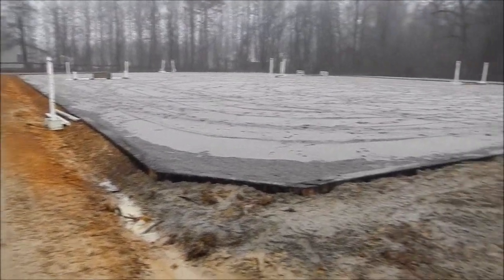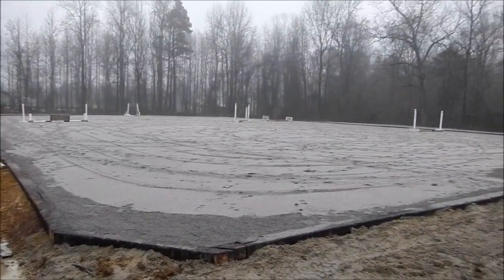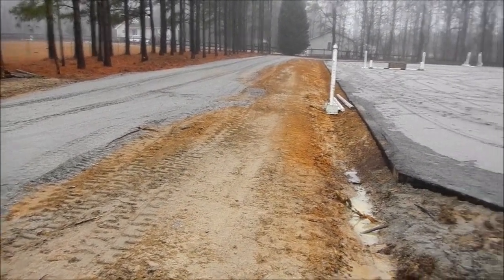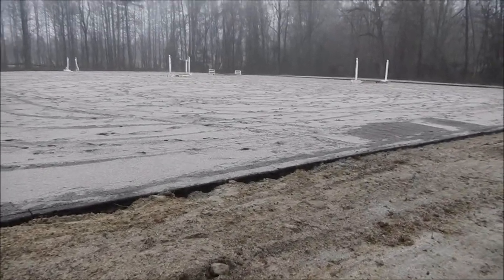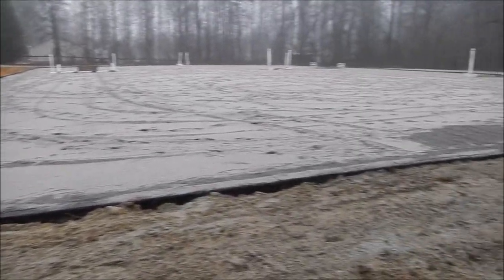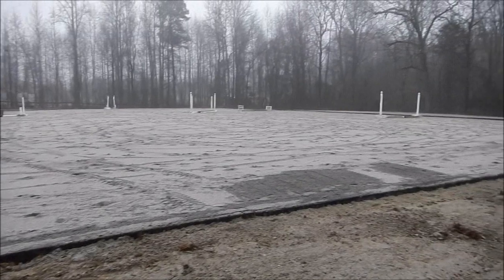Here it is at the end. We've had a lot of rain since I finished it, so I just finally got back out here to get the last piece of equipment. There it is — a 24,000 square foot horse arena. She's already put her stuff in there. We got a road that goes around it where I cut it down. I put a little ditch on the uphill side so the water can run around. I got a four inch crown in it from the center halfway to each side so that the water will run off. And we surrounded it in old railroad cross ties, pounded in the ground with rebar so they're not going anywhere.